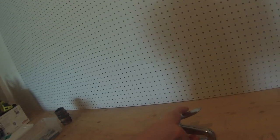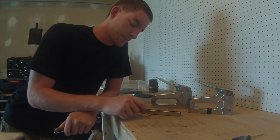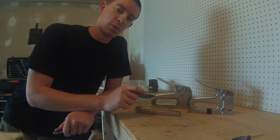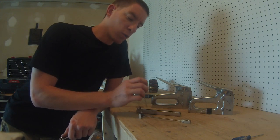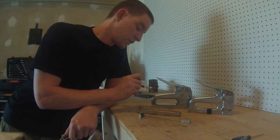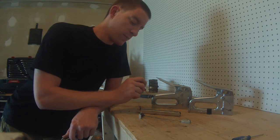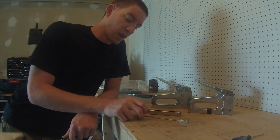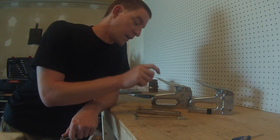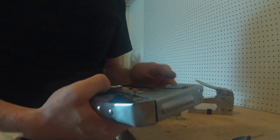Just for comparison, you can see this one operates exactly the same. I did some messing around with these staple guns off camera. The older one works regardless of which spring and staple retainer you use — old and new, new and new, old and old — doesn't seem to matter. But the newer staple gun, which in theory has fewer hours on it, doesn't seem to be working at all. It doesn't seem to be a pressure issue; it just doesn't seem to be loading staples properly. I think it's an internal feed issue. Maybe I'll buy some retainer clip pliers, take the three clips off, and take this thing apart to see what we're working with.